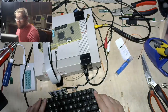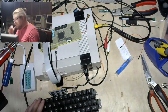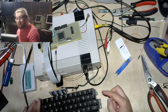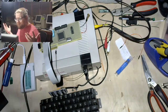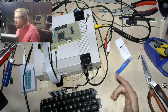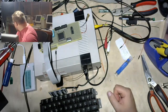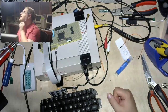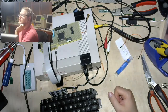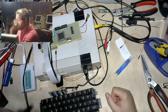So I don't know if that's something that I can actually fix, but first I need to find a machine running BSD, I think is the only way I'm going to be able to do that, because it seems to be Unix and SCSI specific. And so maybe I can try running BSD on my Quadra 700 or something, but it needs to have a SCSI 1 board on it, or any kind of SCSI board, because they should all be backwards compatible, but I don't have anything better than that. So the superblock, no, not the superblock, because that's the first block of the file system, and it's above the file system. It's a block that describes drive information, not volume information.